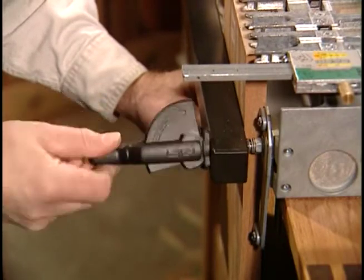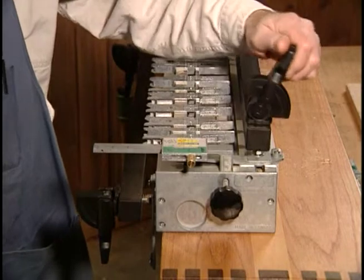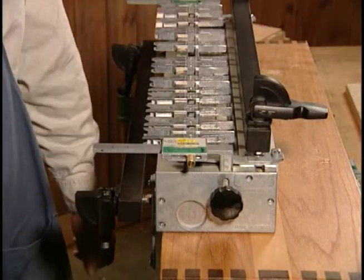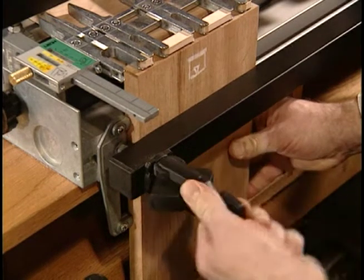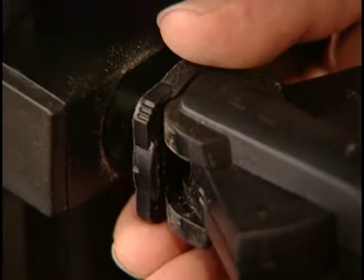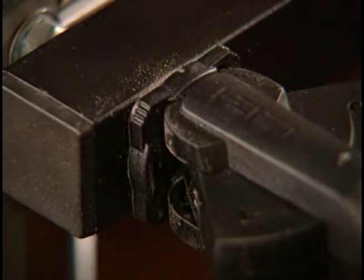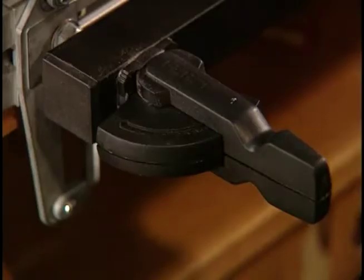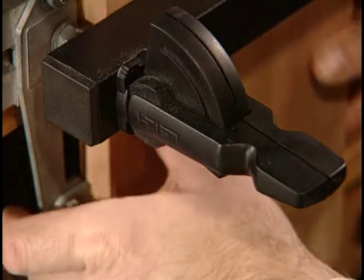Adjust the clamp tension only with the clamp disengaged. When engaged, the front clamp levers should point down, and the rear clamp levers should point away from the operator. If the lever is badly positioned at the correct clamping pressure, release the clamp and remove the board. Turn the step washer 1/4 turn. The step height in the step washer changes the clamp position by 1/4 the clamp bolt thread pitch. Now adjust the clamp to the right position at the correct pressure.